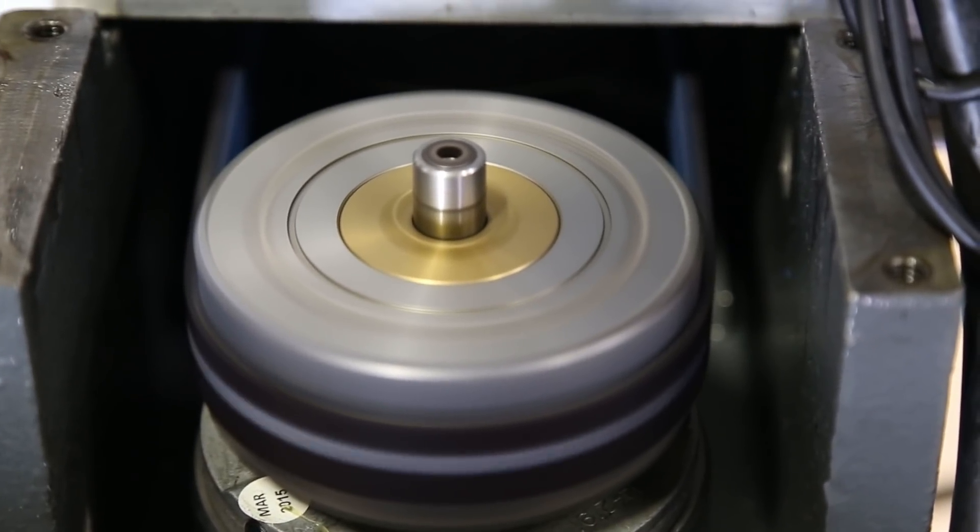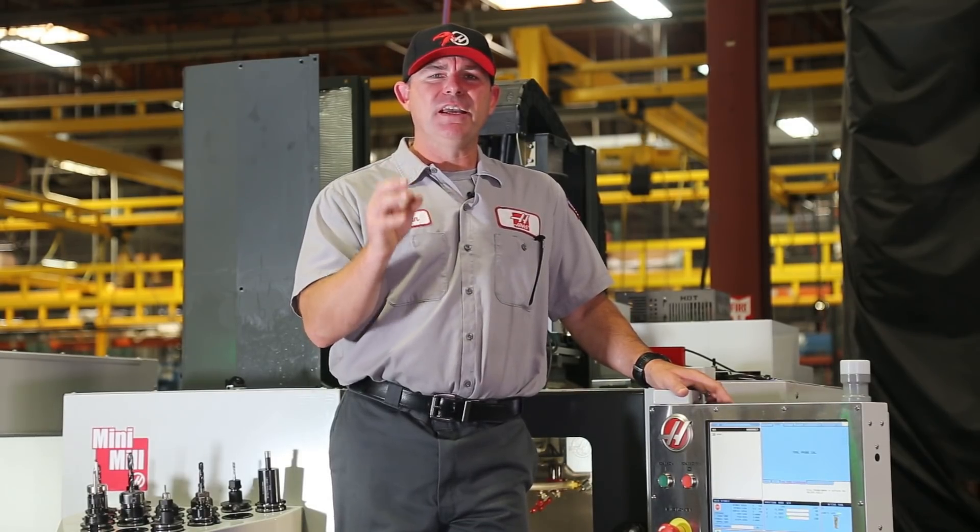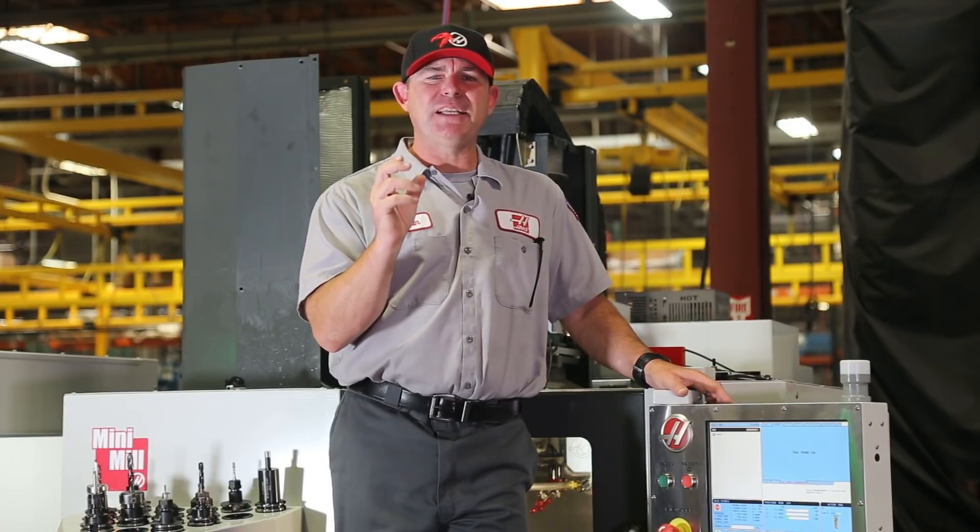You should see that the distortion or the flapping is gone. If it isn't, use the belt tension tool to adjust the belt until you find just the right tension that makes the flapping and the noise go away. This process usually fixes reports of noise and vibration and even poor cutting characteristics.